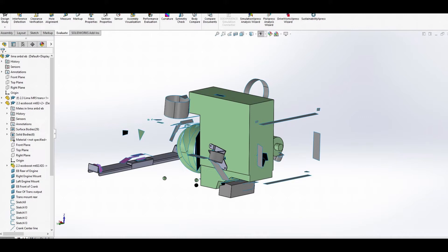You can see our cross member for the transmission and the motor mount on the passenger side. What we did with this is overlay everything and lined up the crank centerline on the vertical plane, so left and right it was correct. I did have to bump the engine up just a little bit - it's just a little bit higher than the factory engine to get some extra clearance on that cross member. Then we bumped it back a little bit, playing with forward and backwards positioning because we didn't want to run under the firewall too much.